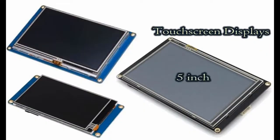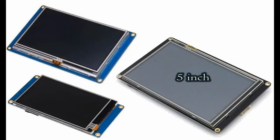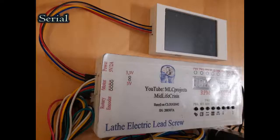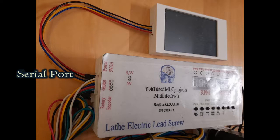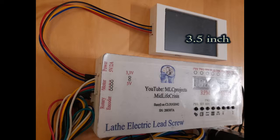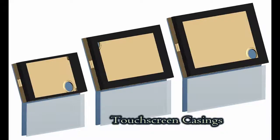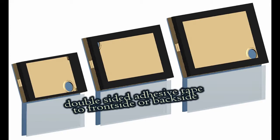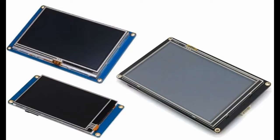Kent van der Velden's code works on a 5-inch touchscreen. My research was mainly intended to see if a smaller type display could be functional on a lathe. I successfully have the serial communication between the ALS and the touchscreen working great, and therefore my ALS hardware is now upgraded with a supported touchscreen port and header for these types of touchscreens. I tried to edit the code for my 3.5-inch touchscreen but couldn't get all the errors out yet to get it working with the stepper motor. For source code, please visit his page linked in the video description. Casings and brackets can be ordered for 3.5-inch, 4.3-inch, and 5-inch touchscreen types, and include double-sided adhesive tape to mount to the lathe. For purchasing Nextion touchscreen displays, see the links in the description.